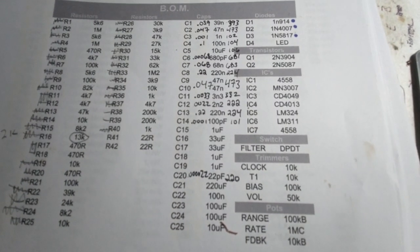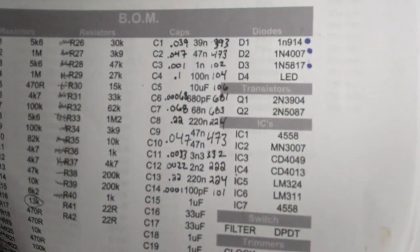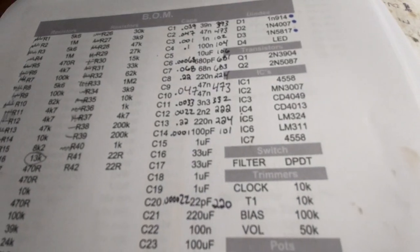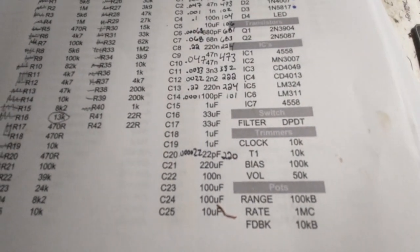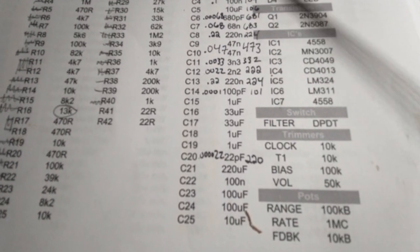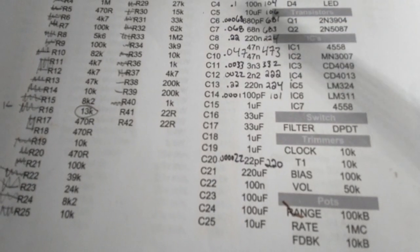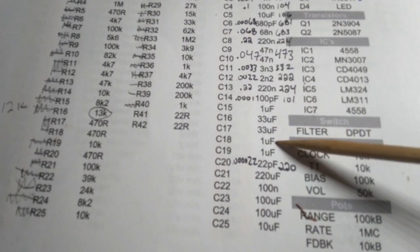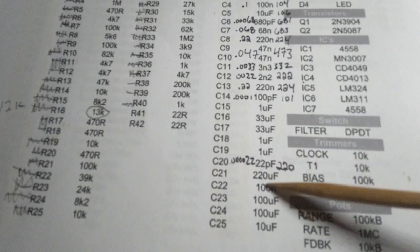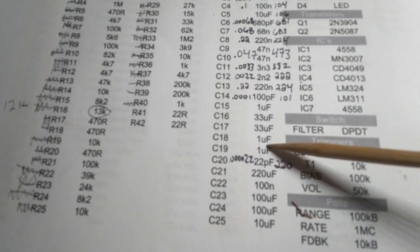After a little more thought, I'm not going to get crazy trying to go strictly from smallest to tallest. If we have to bend legs, we have to bend legs. It's not the end of the world. So we're going to do all the capacitors, from the lowest value to the highest value, and we'll do all the electrolytic capacitors last. From lowest to highest, it would be pico, then nano, then micro. Anything 1 microfarad and above is almost guaranteed to be an electrolytic capacitor. Those are the ones that look like little barrels.